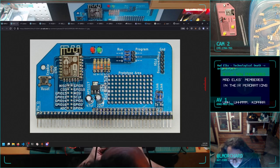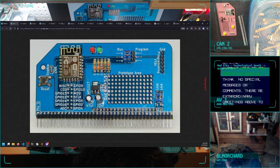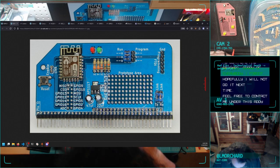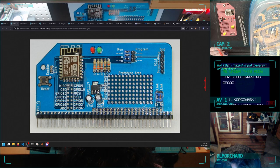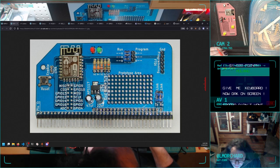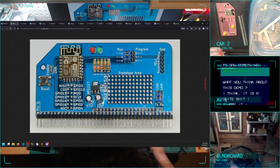Gold, brown, orange, orange. Gold, red, orange, orange. This is where I'm a little confused about resistor values. It's on the circuit board. It's calling for 2K2. I have 2K1. The bands don't exactly match, so I don't think I want to use that part.